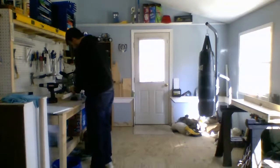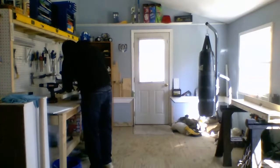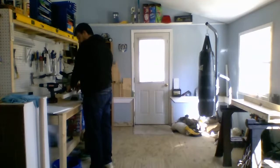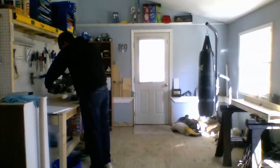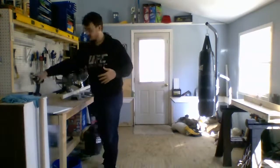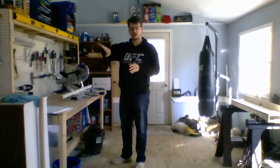My plan is I'm currently putting in a 0 clearance fence here on the miter saw. Since the dowel is so small, I'm a little bit worried about tear out. If you just cut something without any support behind the wood or the lumber, you can end up having those kind of splinters and stuff get kind of scraped out and shot out the back.